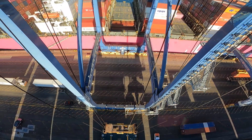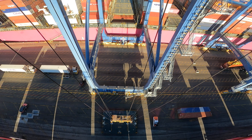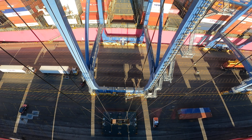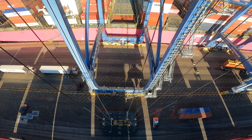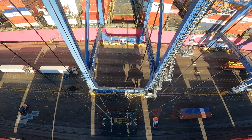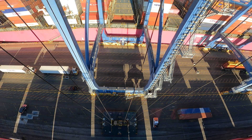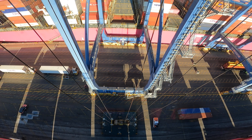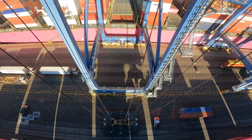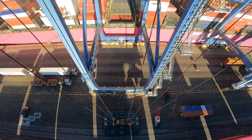I'm pulling back with this one just because the beam was way behind me, so I was making the cab catch up to it so we didn't have a lot of swing. When you look at it right here, you can see it is swinging at least a foot. Sometimes if I was a regular here — it's not going to swing far enough. So I'm going to watch it and just walk it over just like I did last time, because otherwise it's just going to take too long to grab this. If I was at my regular dock, I know what those cranes will do, I know how to make it bounce to land. So it's just a matter of figuring this crane out.